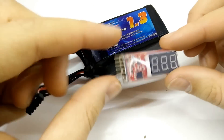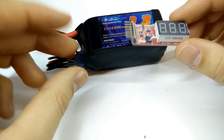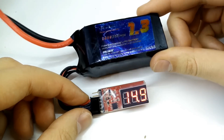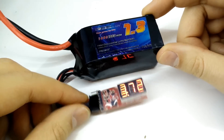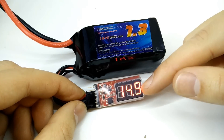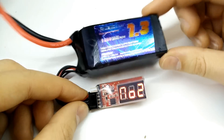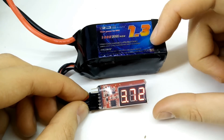You want to get your hands on one of these — they're about two pounds online. Probably buy a couple and just take them out with you when you fly. Before we begin checking your battery, make sure you've got a good high-quality battery, not some cheap knockoff. Also make sure you've got a good balanced charger so you can get all the cells correctly balanced. You don't want the cells to be off by more than five or ten millivolts, as that's going to do some damage. Good battery and good balanced charger is the key.